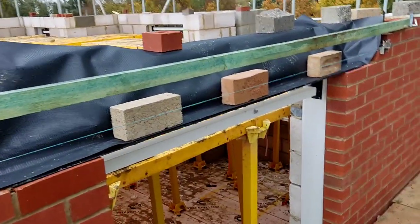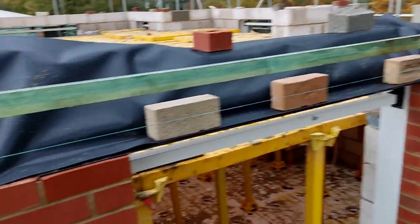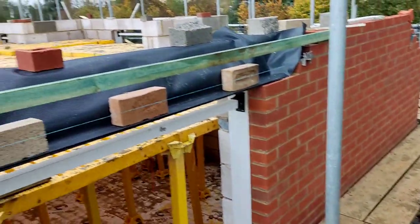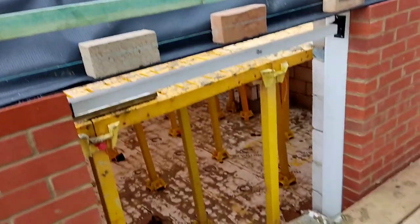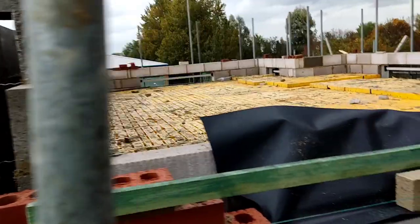It's Friday. I said I'd get my GoPro - I charged it but then realised it's raining so I'm not bringing it up on scaffold. Check it out, it's Sam doing the soldiers. It's easy when you build your fourth lift without your lintels there. Crap weather, everything's covered up. Just put your DPC on - that's the job. I've got my wee profiles on the scaffold; I should ideally have them next to the opening but I've got Tyler's light clamped on every opening by the block.